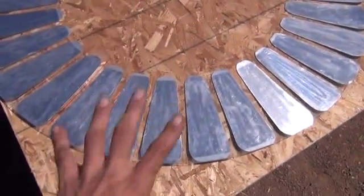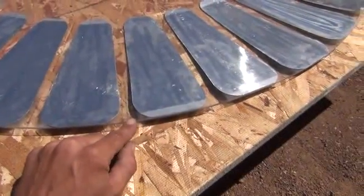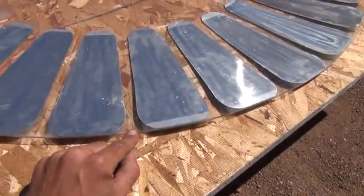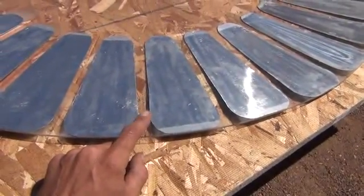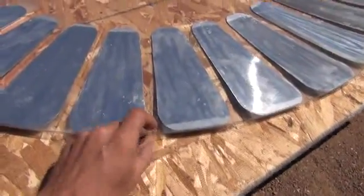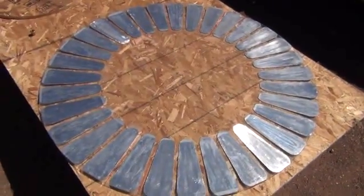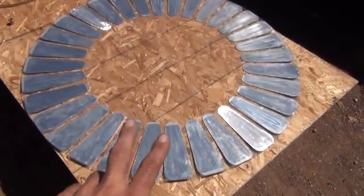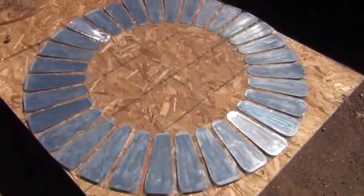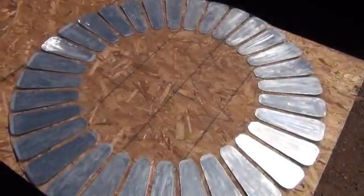The other two we're going to build are actually going to be quarter-inch, which will give us more dielectric material and actually reduce the voltage slightly. The reason I did this out of eighth-inch was the voltage will be higher with the thinner dielectric. So we're going to do two different setups. In the end, we'll have four four-foot-in-diameter discs rotating — one quarter-inch material, one eighth-inch with the supports.